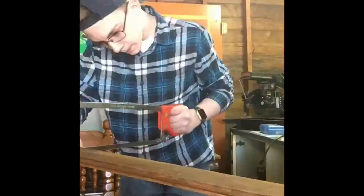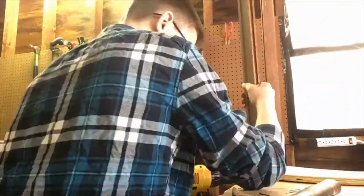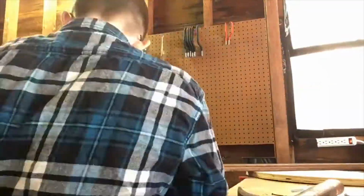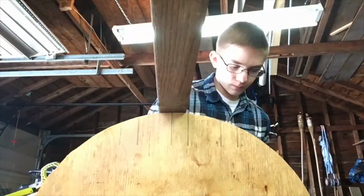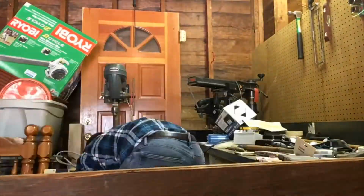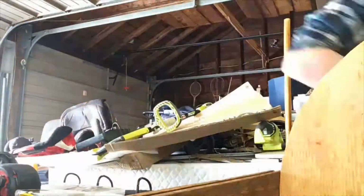The jig consisted of 3 or more pieces of 3/4 inch ply that were cut into a half circle. The jig also included pieces of wood that spanned across the 3 pieces of ply. These were used to connect the 3 pieces of wood to give structural stability and to give me something to connect the piece of wood I was forming to the jig. You can see here that I just attached the pieces of wood to the ply with screws.